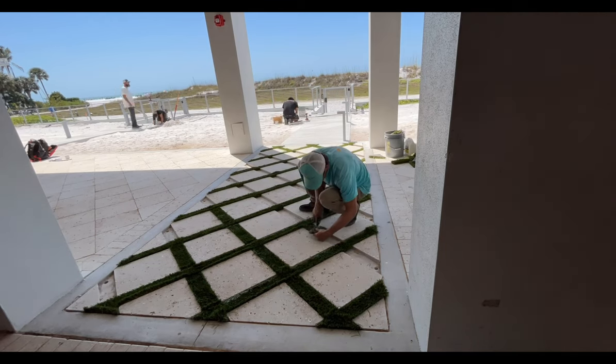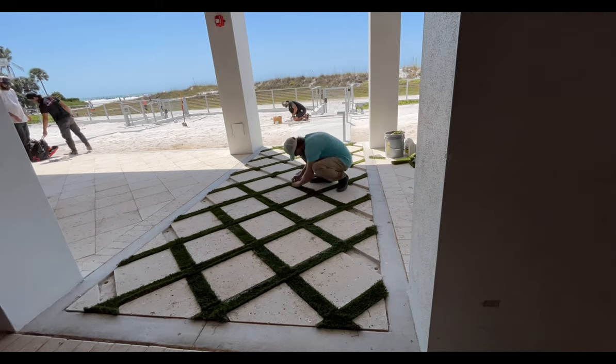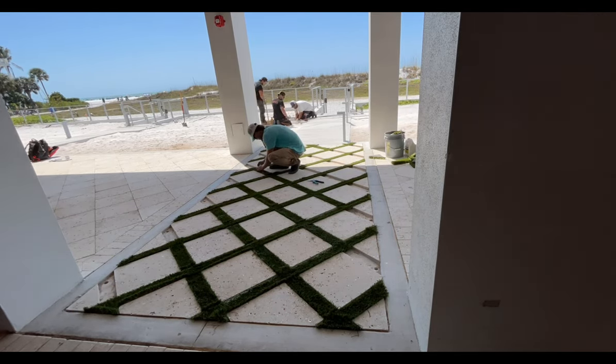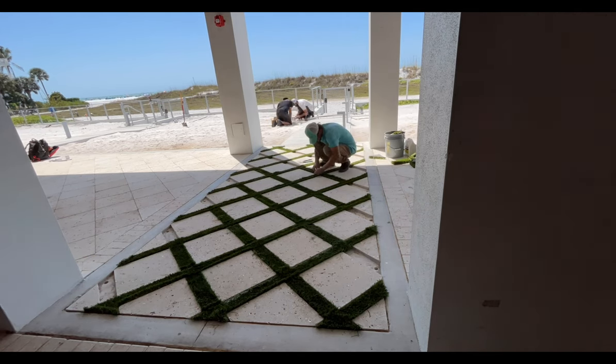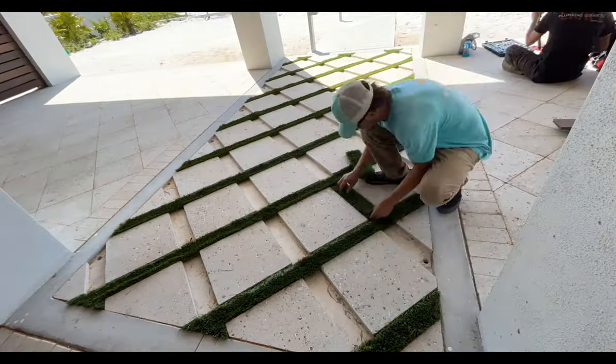turf strips, and I was putting them down and then cutting off some excess, but still leaving a little bit so I could trim whenever we're gluing. The big thing with turf is you don't want to cut off too much. So cutting off a little bit longer than what you need is the best bet so that you can fine tune it when you're ready to glue it down or staple it down. That's when you really want to do your fine tuning at the end of it.